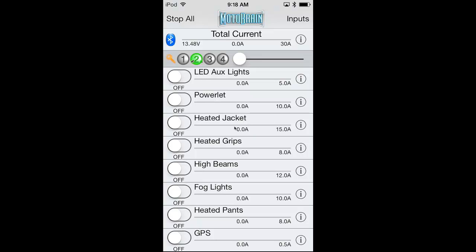Input 2 looks a little different. You can see it's got that white bar at about 8 o'clock or so. What that indicates is that input 2 is set up as a potentiometer. So when you ramp up the voltage on input 2, when you hit the low threshold, it will turn purple until it gets to the high threshold. And then it turns orange. And you can see, while it's shifting around, where you are in its relative voltage compared to the threshold.